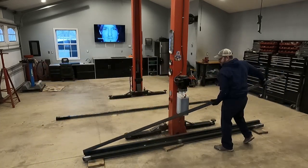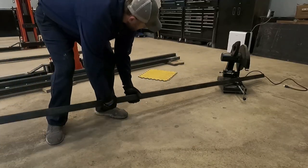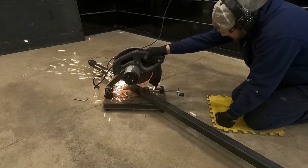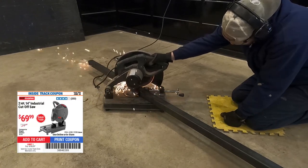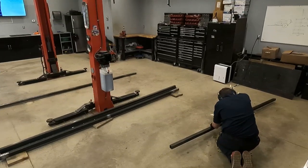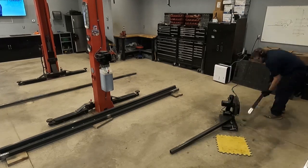And now the build officially begins with my first cut. This piece will be the very rear of the trailer, and each end will be mitered at 45 degrees. I'm just using a cheap chop saw I got from Harbor Freight with a cutoff wheel on. The bad thing about this saw is that the platform's not very big, and you have to make sure that the metal is perfectly square in it before you cut either end. Otherwise, your 45-degree miter will be slightly off.